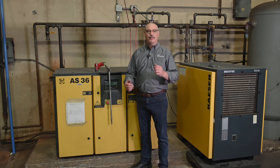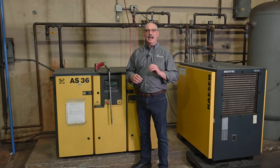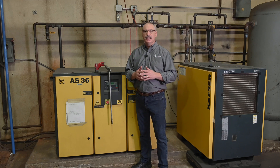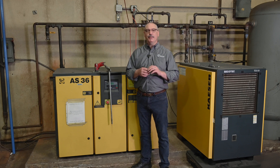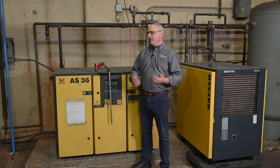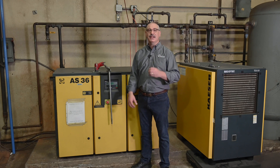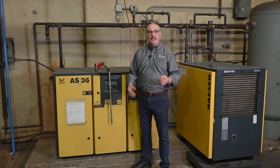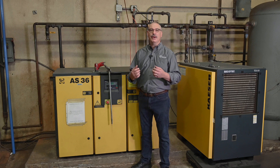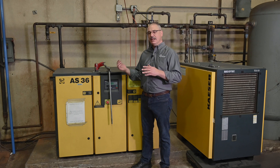In this section we're going to talk about compressed air. Most Multicam CNC routers have a requirement for clean dry air at 100 PSI with a range of about four to eight CFM typically. Multicam recommends that you have a system that will do 100 PSI at about one and a half to two times the CFM requirement. For example, if your machine requires 100 PSI at 6 CFM, you should have a system that can do about 10 to 12 CFM.